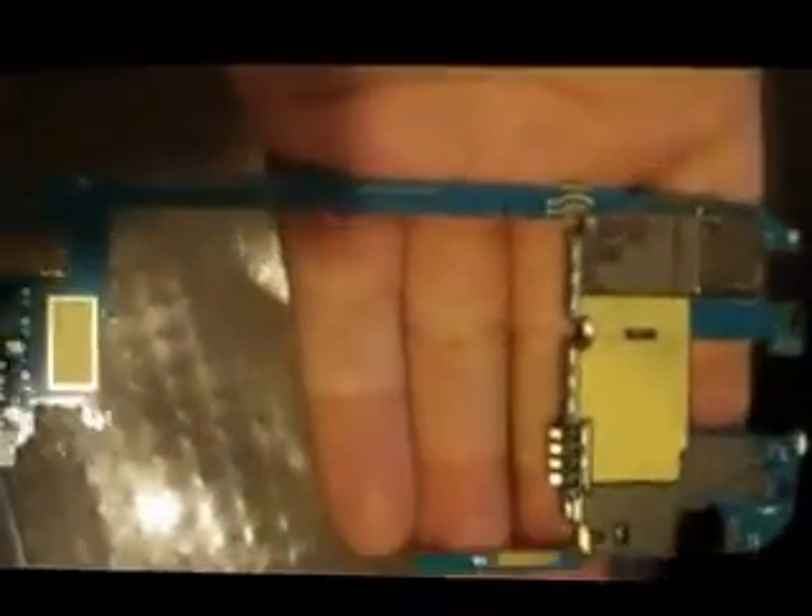I'm basically trying to keep it in a baking pan at 400 degrees for 5 minutes and bake this board — it'll work for about 10 minutes, hopefully. So this is my board sitting on a cookie tray with two magnets to kind of hold it stable. I don't want to have them touch any metal, so it's on wood, hopefully I don't burn my house down. I preheated my oven to 400 degrees and now I'm going to put this in.